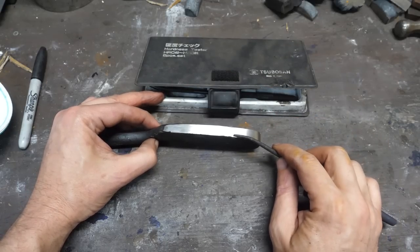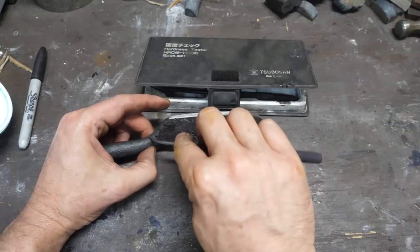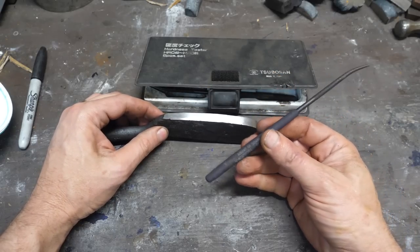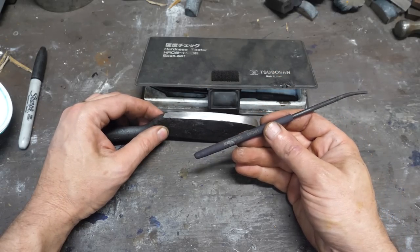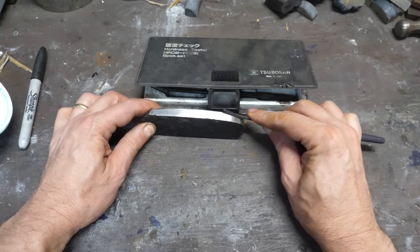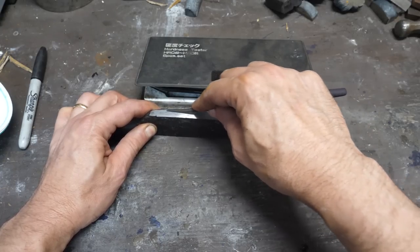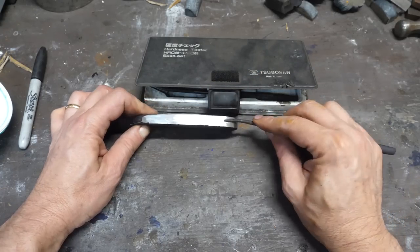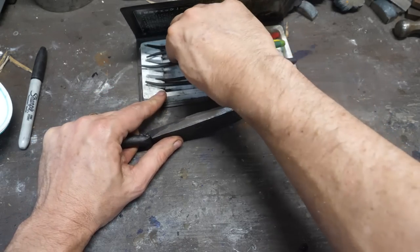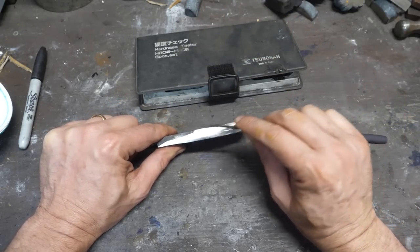So we've quenched it again. I think most of the good quench happened at the tip — that's the hottest part. This is the club side of the face — it should be what we thought was originally hardenable, at least somewhat. Last time we got it to resist a 60 HRC file, so let's try again. Yeah, it's sort of right at 60 probably. The other side is definitely softer — it just really digs in.